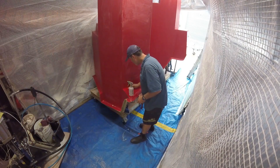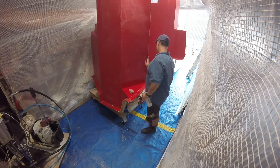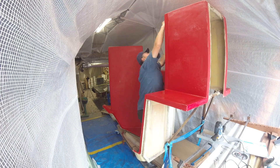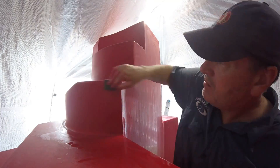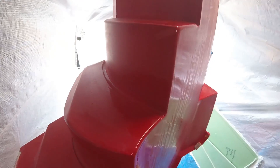To her credit she's done a brilliant job — she high pressure water cleaned it, done everything. So I'm pretty much ready to now do a 1200 grit hand polish as well as a machine polish. Then I'll work through the polishing stages finally to the sealer glaze, which is the release product, the gel coat sealing product. And then I'll work into my release waxes. Probably two or three good days of work just to get this thing restored, then next week, provided it stays cool enough, I'll get on to gel coating and glassing it. It is middle of summer, so anything goes at this time of year.